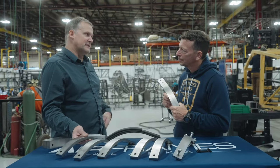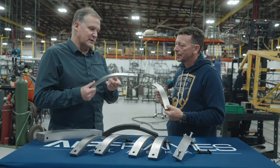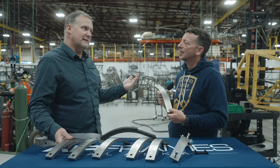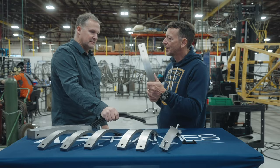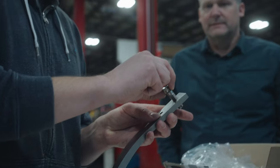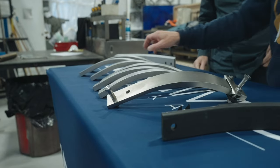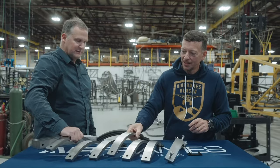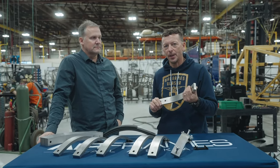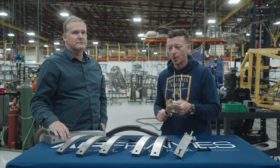We're taking weight off with this spring while the suspension ones are adding weight. This titanium spring is really more flexible than the steel one, so you get a little bit of that shock feeling — not to the same extent — but a little more than steel, with something simple you bolt on and walk away from for the life of the airplane. Say I don't like the color of titanium — can I paint these? You can paint them whatever color you want, but there's no need to because it's totally corrosion resistant. Just to reiterate, these are experimental right now, but they'll be available for sale on our website. You can go there for availability and pricing, and we are pursuing the STC for these as well. There'll be more news on that as we move forward.